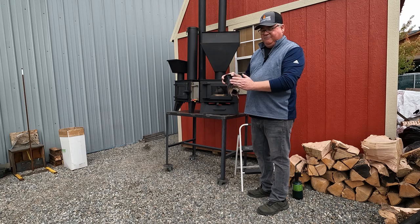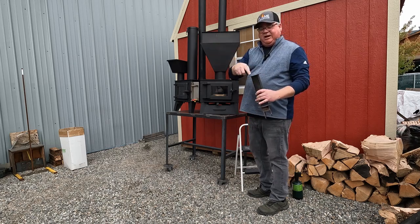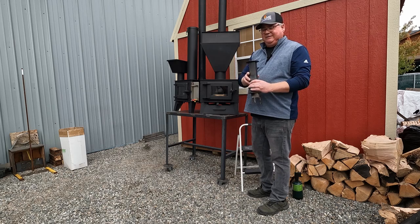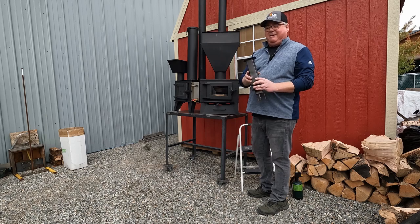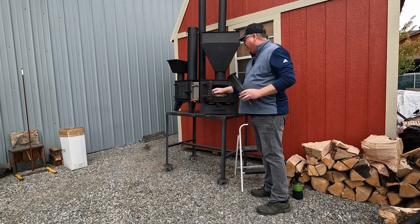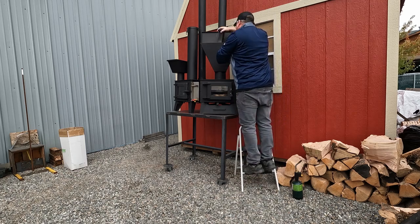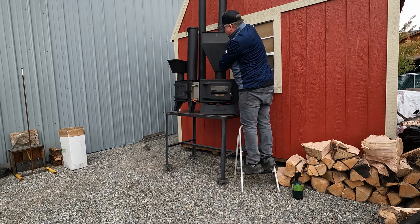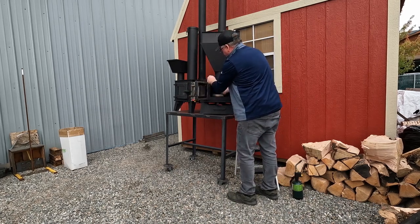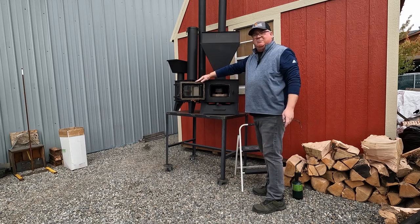You'll also see where the heat transfer is here, so that lets you know we're only burning in the tube from here down and in the fire pot. It's totally safe — when you look down your feed tube or through your hopper, you'll see brand new pellets just sitting right here on the edge. A question we get asked a lot is whether it burns up in the tube, and the answer is never in our experience, but we take precautions. To install, open the door and lay your fire poker across the top of your bricks, then drop the adapter right down the feed tube, catch it, lift it up, and pull out your fire poker. Now it's sitting inside the fire pot and ready to be filled with pellets and lit.